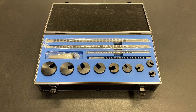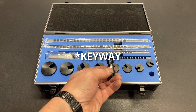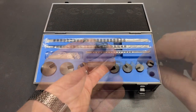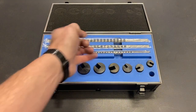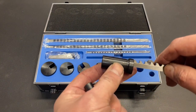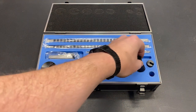Before I show you how I end up using this, I'm going to show you the one thing that I'm not real happy about. This is my half inch plug that guides the broach when cutting a key into a half inch hole, and this is the actual broach that fits in. The problem is when we slide the broach in, you can see that the end is sticking out ever so slightly. That shows that this groove was not cut deep enough. If I grab this one right here, also set up for 3/16ths, it's flush — in fact it's just a little bit below. So I'm going to have to take a little time and clean up this half inch plug.